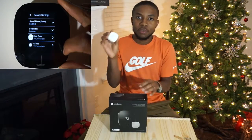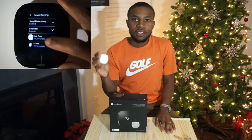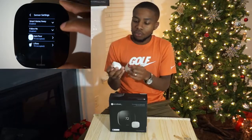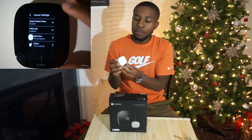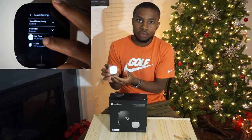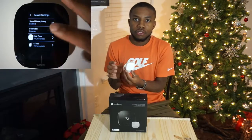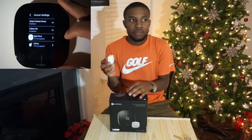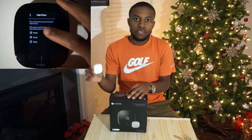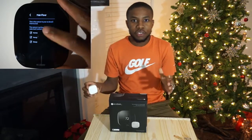What I'm doing is putting these sensors into the places where I need heat and air conditioning the most. These sensors measure not only the temperature of that room, but also sense the presence in the room — whether somebody's in there or not — and also the humidity. Using that information, it's able to say 'this is where this person is, and the temperature is not where it should be.'